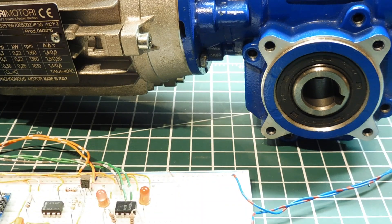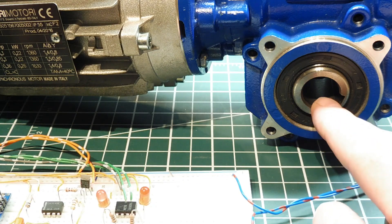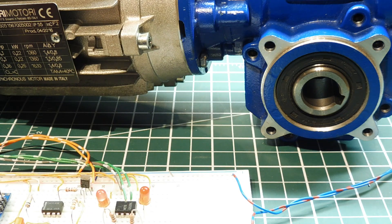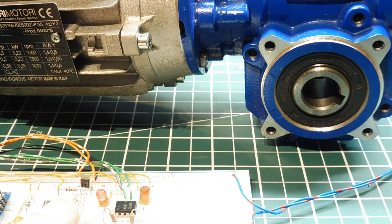This is my three-phase motor coupled up to a gear drive. The gear drive is available in different gear ratios, and the output takes keyed round stock to drive your project. If I give some current into my current loop through my keyboard, I can start up the motor — you can see the clockwise LED on my breadboard indicating forward direction. I'll give it some current and slowly bring it up — it's running clockwise. I can bring it up to speed or back down by changing the current in the current loop, and bring it all the way back down to stop.